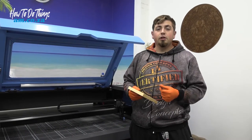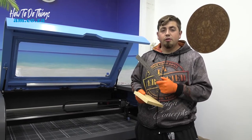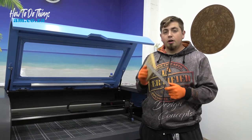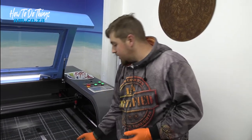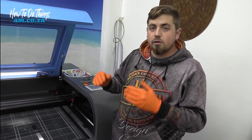So now that you've been given two methods to do your leveling, today I'm going to be using the ruler method purely because I do not trust this being square, and I'm going to rely on accurate measurements to do this properly. So there's two ways of doing this. Either you can move the bed up until it's absolutely flush on one corner, and then you move the worm screws underneath in order for them to all be the same level, and that's with your eye.